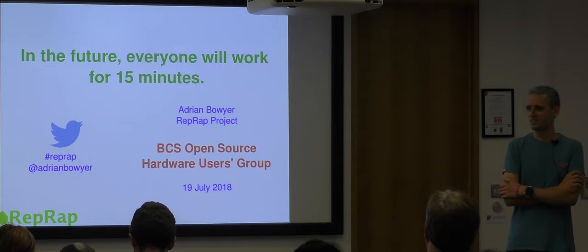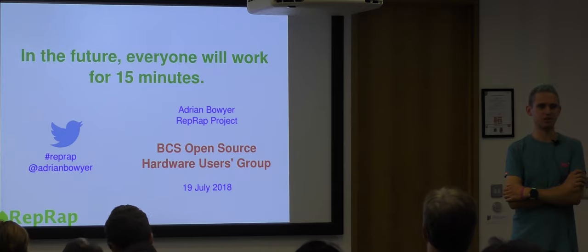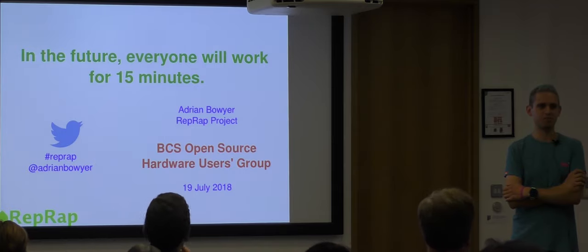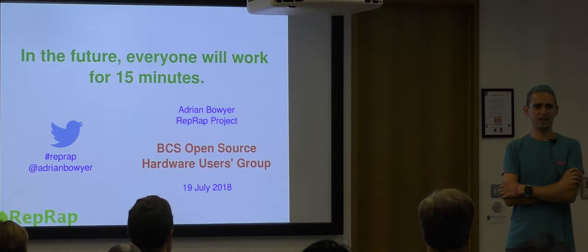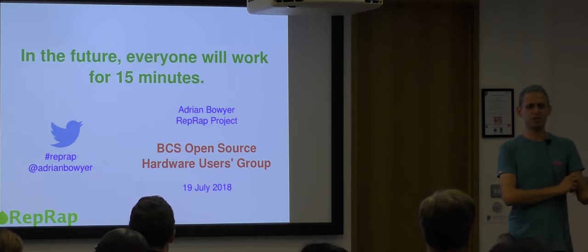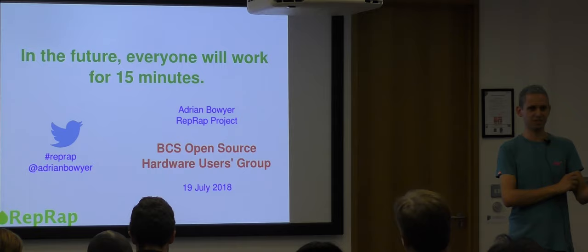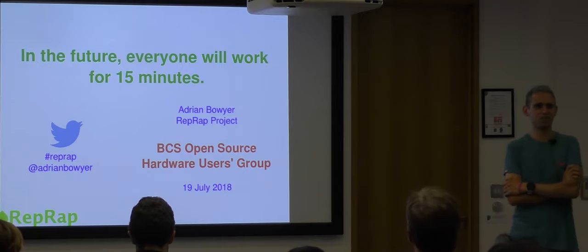Generally, it doesn't happen that often. It only happens when you're doing something new. Once you've got a Delta machine printing, it will just print for you. And in fact, sometimes more reliable than a Cartesian machine because of that calibration step at the start. In fact, I put a bed probe on my Cartesian machine now as well, because when I started printing with a Delta, the fact that there was no Z end stop was so much better than having to tweak the Z end stop to get my first layer right, because it just did it right every time.